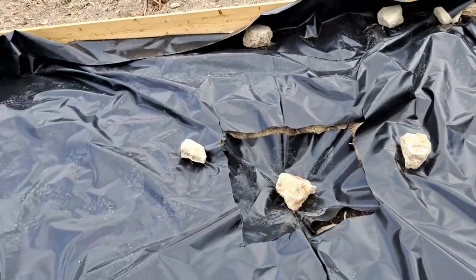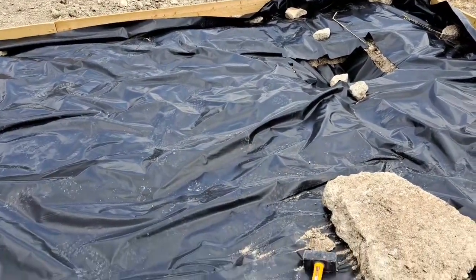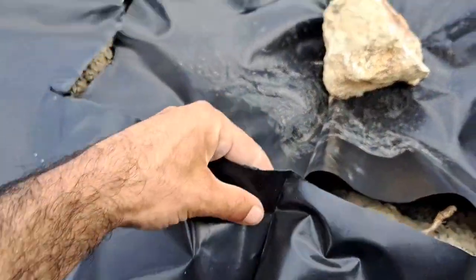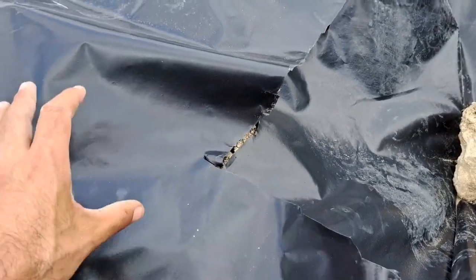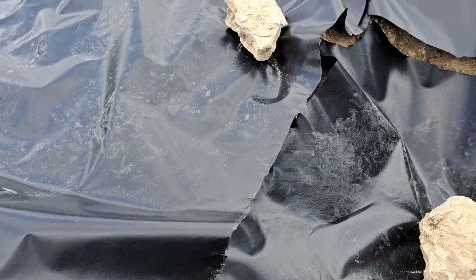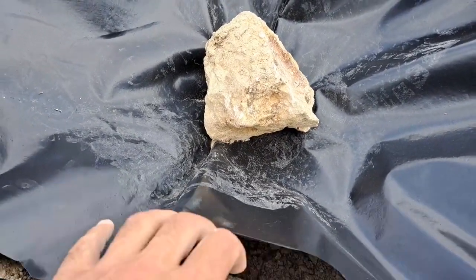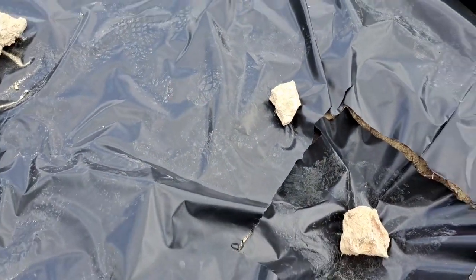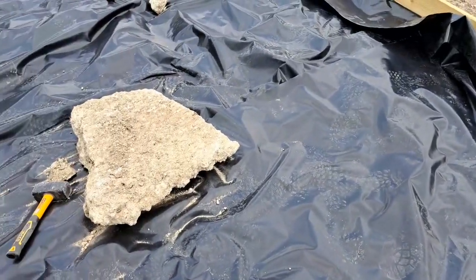And you can see this black colored sheet is the plastic that I have placed on the ground. This is a thin sheet of nylon, and you can see it over here. The idea with this is to insulate the concrete from the humidity coming from the earth. However, I am not really concerned about the humidity because this land here is very, very solid. It is compressed soil, and thus it means that no humidity is passing through it.